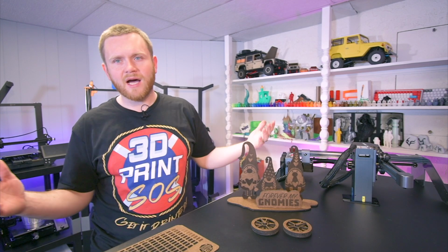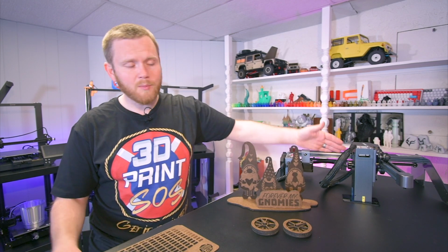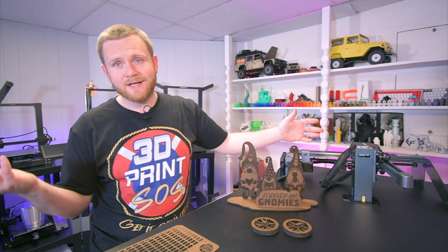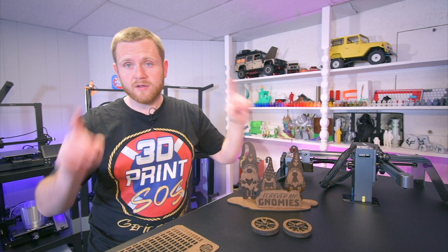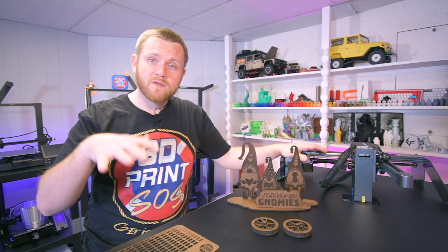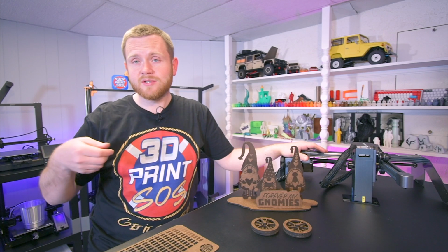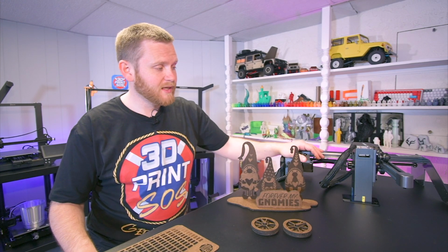One is kind of just because it's a diode laser, I can't do clear or transparent acrylic. I bought a ton thinking I could do it even with the old machine, and you just can't because the laser goes right through it, and because it just goes right through, it can't cut or engrave it. With glass, just like I did in the X7 video, check that out up here, I ended up spray painting a piece of glass and then engraving in reverse over top of that, and then using a razor blade to clear off the spray paint, and that worked perfectly to etch glass. But you can't do that with acrylic because you wouldn't be able to use a razor blade on the acrylic afterwards, so you would just have black acrylic. It would kind of defeat the whole purpose. So that's kind of a bummer.